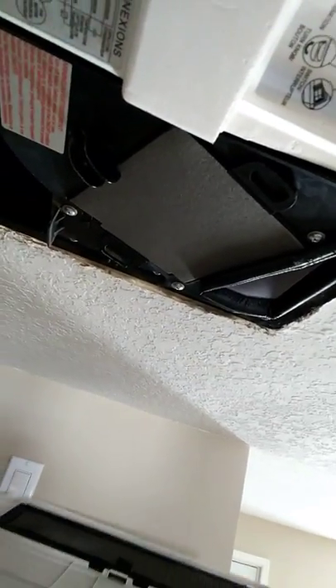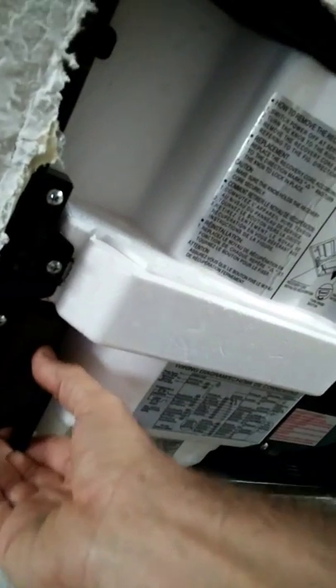The ERV has metal tabs that come off. I'm going to go ahead and turn the fan off at the disconnect switch. There is an air filter right here that comes off and can be cleaned. Then there's another filter right inside here that just pulls out. Oftentimes there are a lot of bugs and critters in there. This is a washable filter.